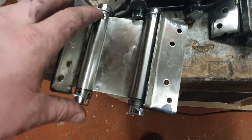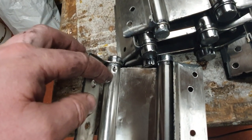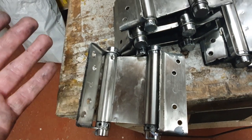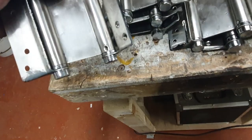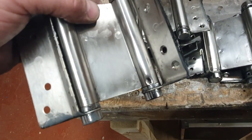These hinges being mounted upside down - all the weight is pulling down - and what it's done is pulled that section out and allowed that point to rotate freely, basically making the spring tension null and void. Keeping them the correct direction means that isn't going to happen.